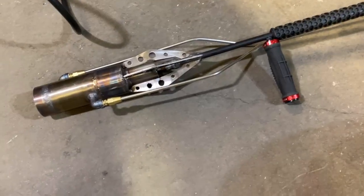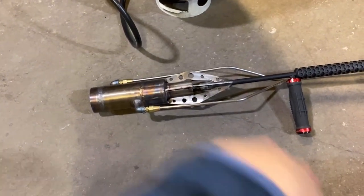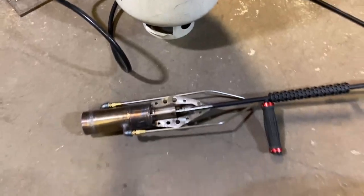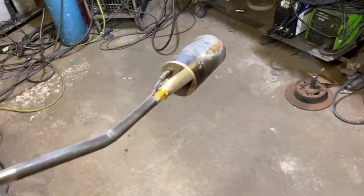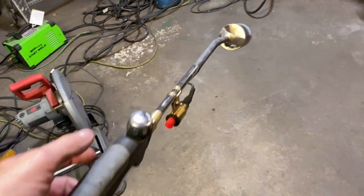It's too late at night to test this thing out on anything. We're going to take it outside tomorrow first thing and do some cold weather testing to see if it holds up the way it's supposed to. Once this thing gets a little bit of liquid propane in there, it'll pretty much supply itself with about 500,000 BTUs of gas continuously — unlike these other torches where you lose bottle pressure pretty drastically. I recently dried a bunch of limestone and pet coke with this thing a couple of weeks ago and you would lose flame power pretty bad. This flame really falls off after it's been running a while, so we'll take a look at that.